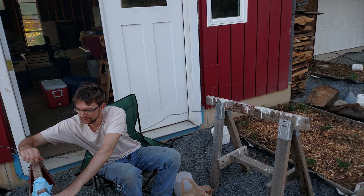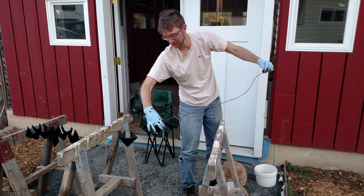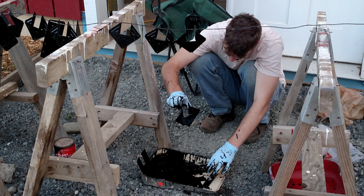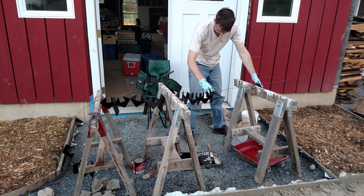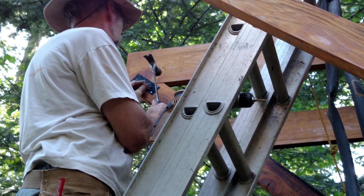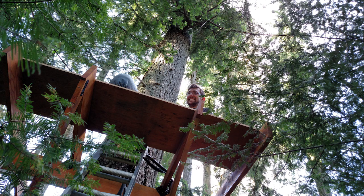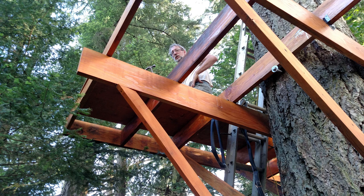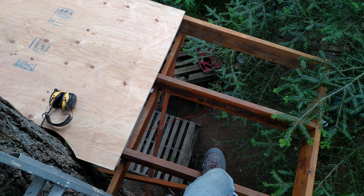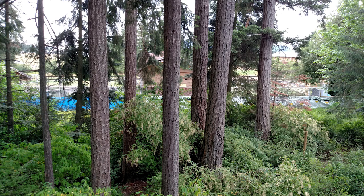For a lot of the tree house I didn't take any videos, just a bunch of pictures, so I'm going to have to narrate what's going on — sorry, I've got a tree house to build. I bought attachment hardware, it's probably galvanized but I'm painting it black because I think it looks nicer. Those are the hurricane ties — very important for keeping the joists from popping off while we're walking around up there. And here's a regular old plate that I put on every single one of the 45-degree supports just to hold it.